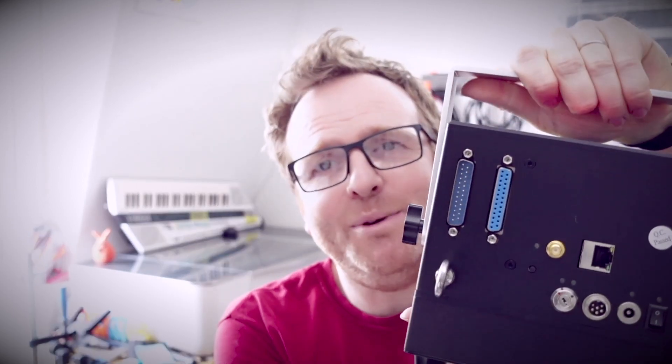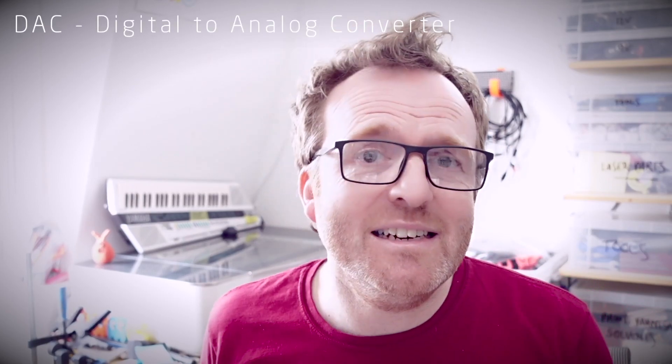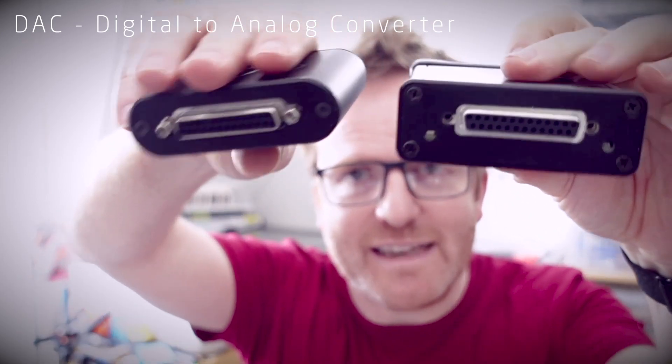There's a standard format for these analog signals — it's on the back of most lasers, you've probably seen it before. It's a 25-pin D-type connector and that is the standard ILDA connector. ILDA is the International Laser Display Association, an international trade body for laserists. One of the first things they did when they formed — over 30 years ago — was create a standard for these analog signals. Since we're controlling lasers through computers, we need a controller to convert a digital signal into an analog signal; that's why they're commonly known as DACs — digital to analog converters — and all of the DACs I've talked about have ILDA outputs.